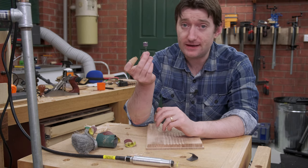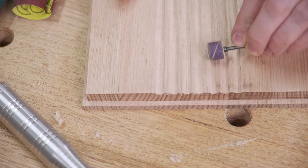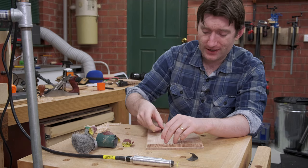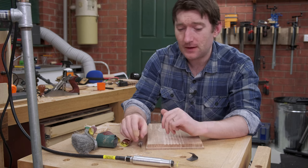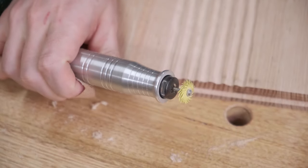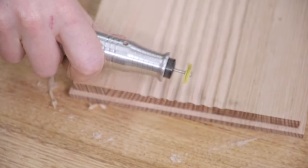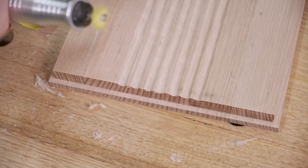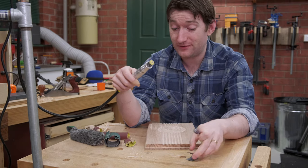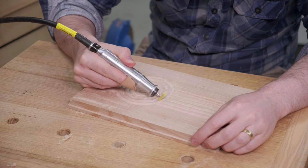For rotary tools you can get sanding drums that come in a variety of different diameters, but for this type of carving with a cove-like shape they're too firm, so you're going to end up creating more of a v-groove. An alternative is the sanding star — this is almost like a dado stack but for sanding discs. You stack three or four together and they create a sanding mop type thing. Because they're soft and flexible, they conform to the shape of your carving and do a pretty good job of cleaning out the marks.